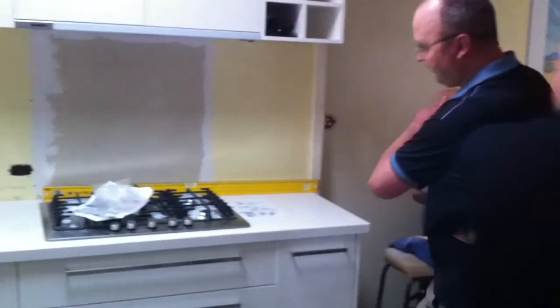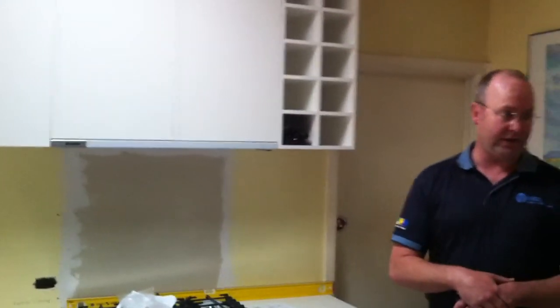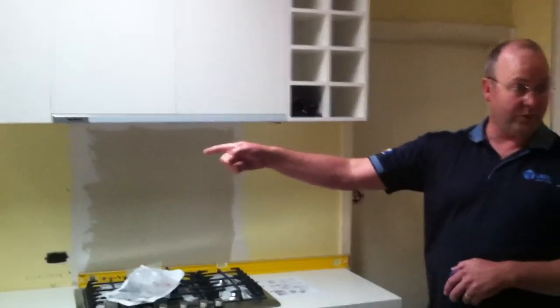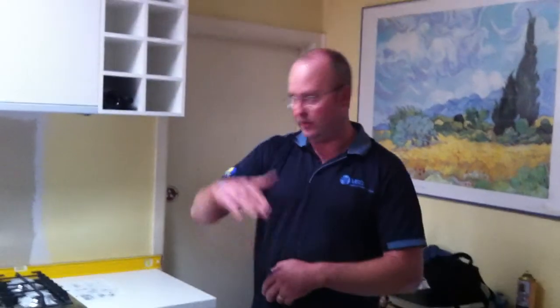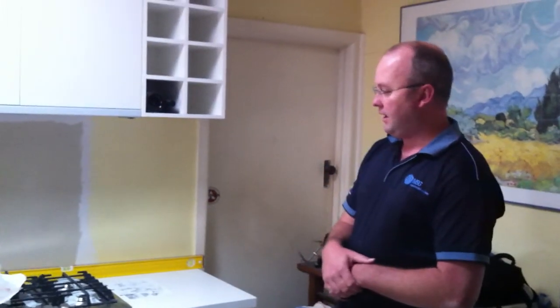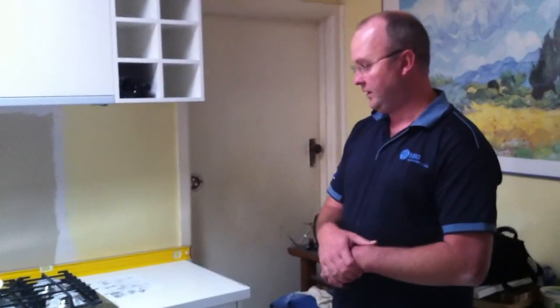So hypothetically, if it was going down 5 mil here, and this tight size was 700, I'd be looking for 705 tight at that end. If it wasn't, if it was 701 or 699, it's a parallelogram. So it's running the other way. So once I've established that, I deduct my deductions, being 4 to 5 mil, depending on situation, but that's generally how I measure: tight minus 4 or tight minus 5 mil.